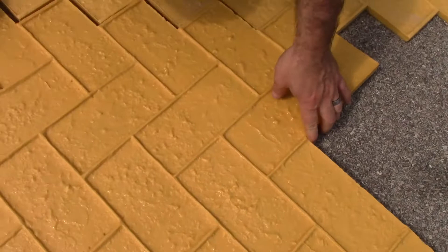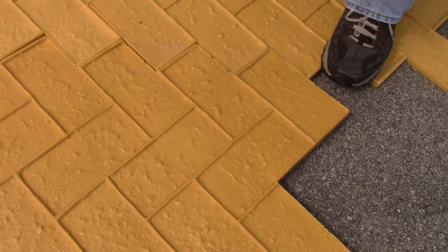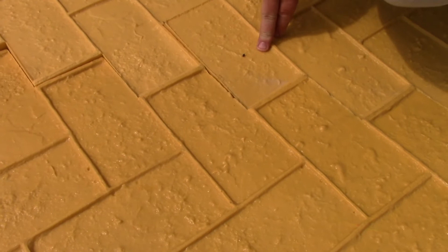What it does is it extends the row and creates a very funny-looking band down the center of your piece. In addition, you're going to have double grout lines in some places and no grout lines in others. So it's going to look very funny. It is important that whichever way that arrow is pointing on your first row, every subsequent row is going to be that same way.